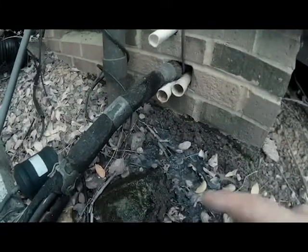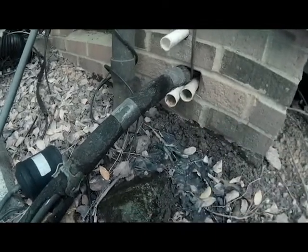You can see all on the ground here is this goop that was stopping up the drain line — that was the whole problem. It's not low on Freon; it was simply a stopped drain. We're getting about a 14-degree temperature drop right now, but it's very humid in the house and we just turned the system back on. As it runs and removes humidity, that temperature drop will come up to where it's supposed to be. To be exactly sure, we're going to check the superheat and confirm it's within proper range.